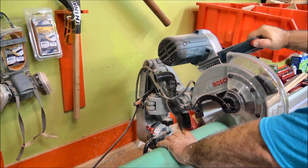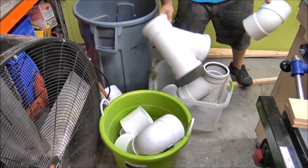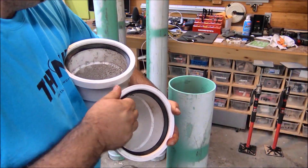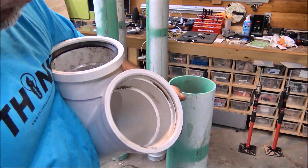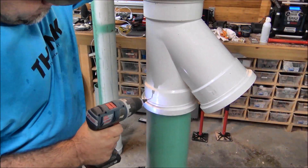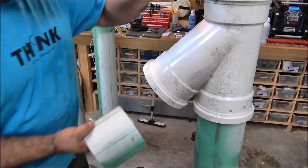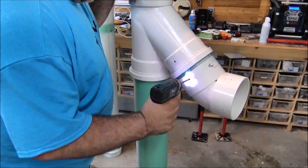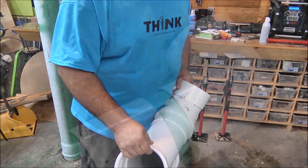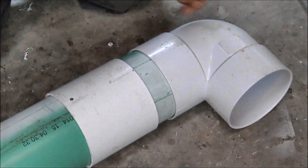Once I had a good idea about the piping layout, I made all the cuts on my chop box. I had to flip it over to make it all the way through the six inches. I'm using really heavy-duty T's and Y's that have a grommet inside — I'm taking that grommet out because once you get those on they're almost impossible to get apart. I'm running two screws on each side to hold everything together, and then I'll come back later and run some silicone around the outside of the fittings. Once I got to this point, I laid everything down on the floor and did the rest of the assembly on the floor for the pipes that would go up on the ceiling.